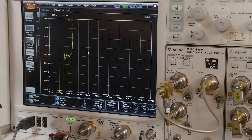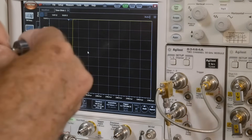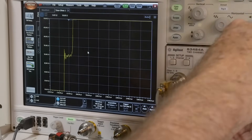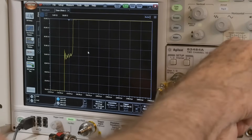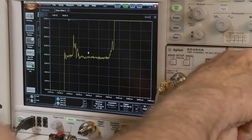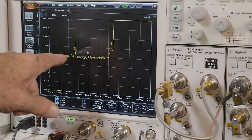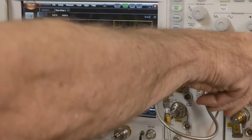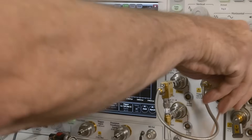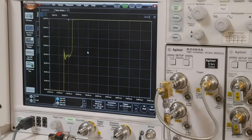All the cables seem to check out just fine and they're super high quality. We'll go ahead and test this last one here, which is the real cheapy one that I kind of bad-mouthed. We'll let it redeem itself. It's got right angle connectors, so we should see a little bump on that one too. See - it's much worse, much, much worse. So anyway, it's just a cheapy little connector. It does have stainless steel parts on it though, which is nice. But the good ones - the really good Pasternak and United Microwaves - have almost no transition at all.